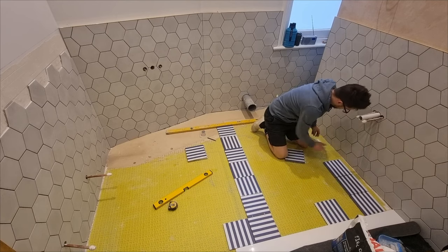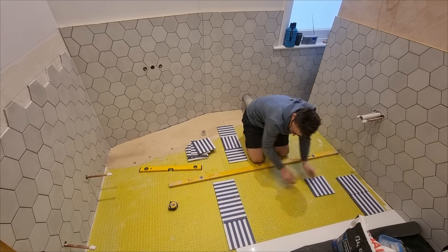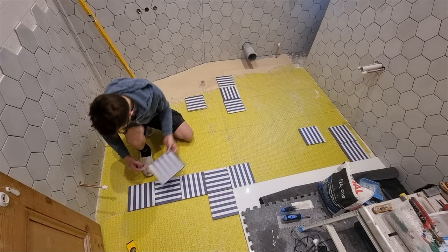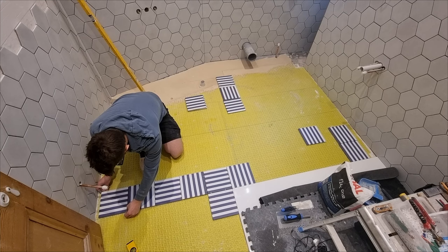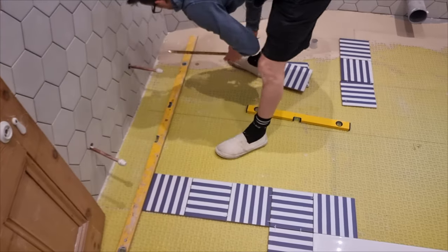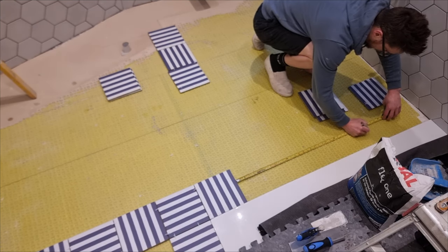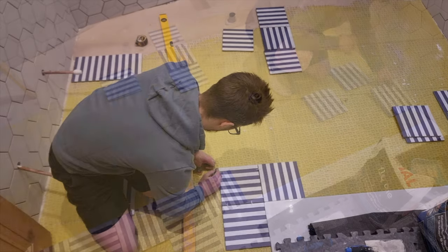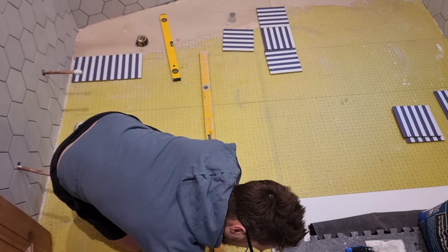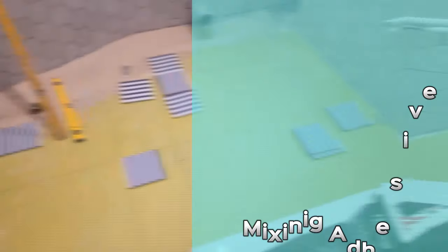I do a check to the back of the room to see how it works out on the bath waste and cubby hole, and that's all fine. While the tiles are here, I'll put a couple of rows down to what I think I can reach when spreading adhesive and draw one of my start lines. By marking the tiles I laid out, I can use my level to draw a line. Checking the room going across, coming off the side of the shower tray gives me a bit of a silly cut, but there's a towel rail there, some of it is behind a door and some behind a bath. So as long as it's square, I'll go with it to show as much of the pattern as possible. I'll take a measurement from a few tiles and check to the other side - that works out fine. Now I can draw the line going up the room to make my starting point, hitting these two lines.